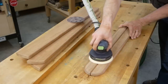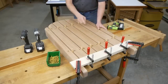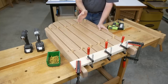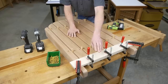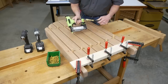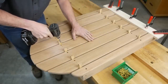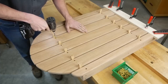Ease the sharp corners, round over the front edges to prevent splinters, and sand them smooth. With all back slats ready to install, insert quarter-inch spacers between each slat to keep them evenly spaced. Draw layout lines to center all attachment screws on the top and bottom cross pieces, and pre-drill counterbores for the installation screws. If you have a pin nailer or brad nailer, tack the slats in place first to keep them from moving as you drive the attachment screws. Fasten with 2-inch exterior screws; note that hole positions are offset on the narrow slats to avoid screw locations where the backrest supports and cross pieces connect.